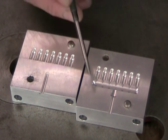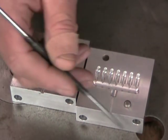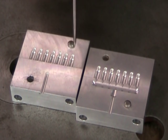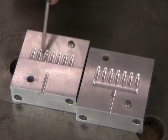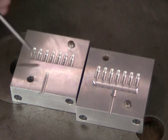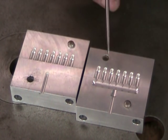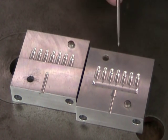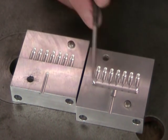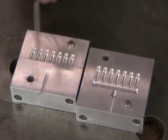Another thing that I want to mention, because I've already mentioned it quickly, is that each half mold is made of two parts and that they're screwed and doweled together. Now we can't see the dowels because they're inside there. They're made into two parts each more because it simplifies the fabrication of these cylindrical cavities that I could produce just by drilling with a regular drill bit, which really simplified the fabrication. Had I made each half mold in one solid block, it would have been quite difficult to produce these cavities. Not impossible, but a lot more complex. So even though it would have been simpler to have a mold in just two parts, since we simplify fabrication quite a bit, these four parts make it a lot easier.